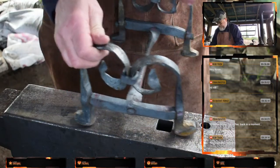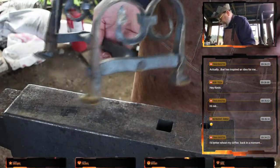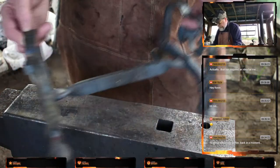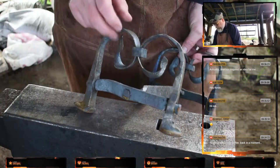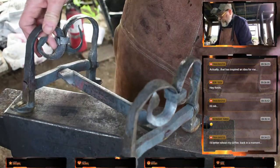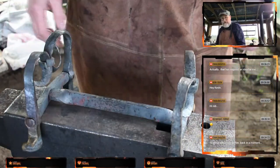that was a pain, mainly because I was still trying to heat using my propane forge. Now it's a little bit bent, a little bit wonky, but it is functional, and I'm pretty happy with it. Really kind of proud of the scope of the work and the execution, though it has areas of improvement. I learned some things about doing these blown over leaves. Starting with thicker material would probably be smarter, simply because I could put better bevels on it. But also, blowing them over in the right direction is something I figured out how to do in the future. I did reverse the process, but reversing the process wasn't quite the right thing to do. But all in all, it is a functional boot scraper, and I'm pretty happy with it.